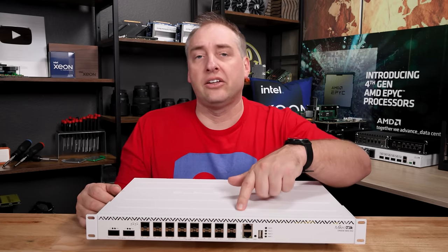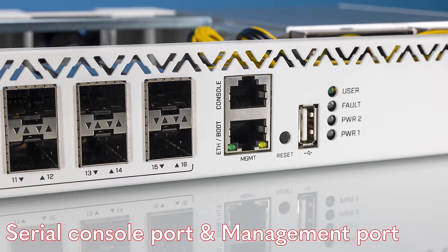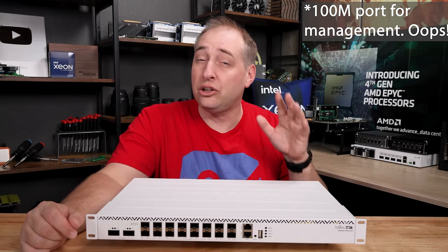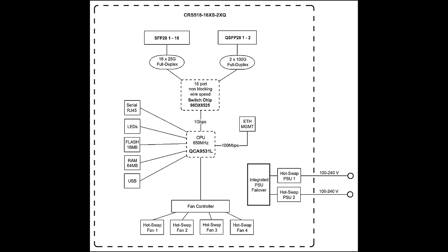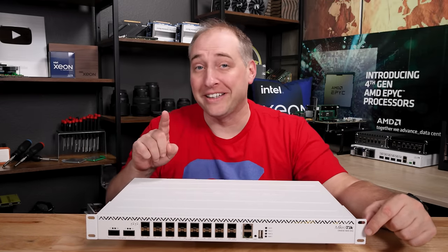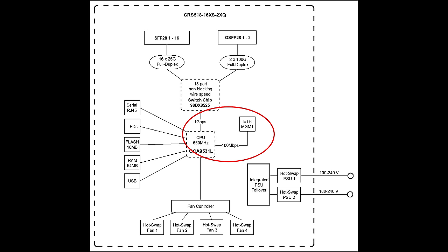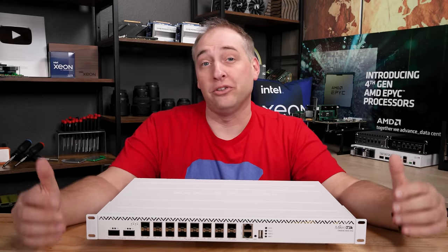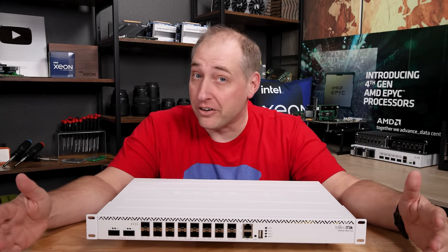On the front of the switch you'll also see both a serial console and a management port. Even though this is mostly a 25-gig and 100-gig switch, there is a 1-gig port used for management. It's a little funky how that's connected — you can bridge a connection from the 100-gig port over to the 1-gig port, but you're actually bridging from the Marvell switch chip over to the Qualcomm management CPU, so the performance on that wouldn't be what you'd consider a wise network architecture. However, for out-of-band management, it's absolutely awesome, and I think all switches should have an out-of-band management port — it makes it so easy to put that 1-gig port on a management network and keep management separated from your data ports.